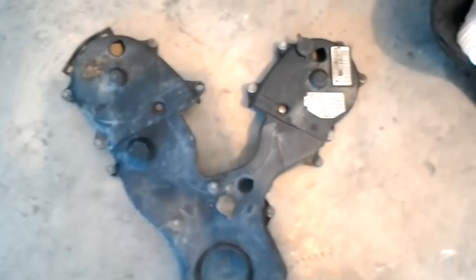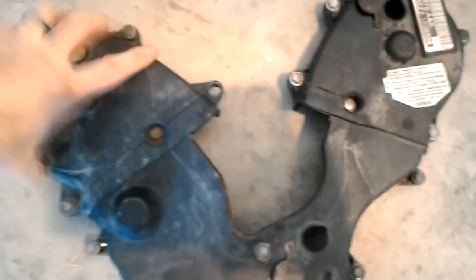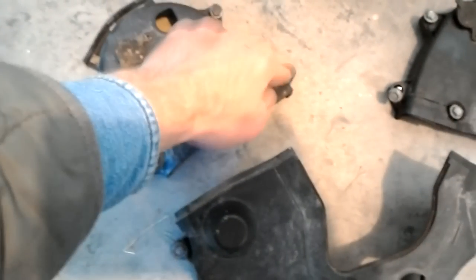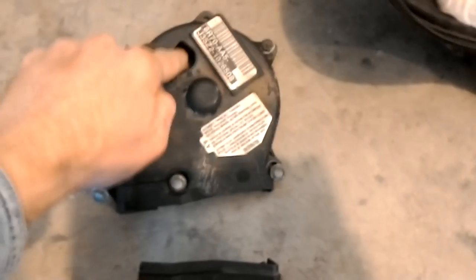This is all the plastic cover business. I wasn't scared of it, but where all the bolts are is a little bit of a mystery, especially when you can't see them. You have one cover piece kind of trapped here, and another trapped on a lip. This piece has five bolts in it, and this piece also has five bolts in it. There are handy little windows — you've got to get it to number one TDC before you start taking stuff apart.